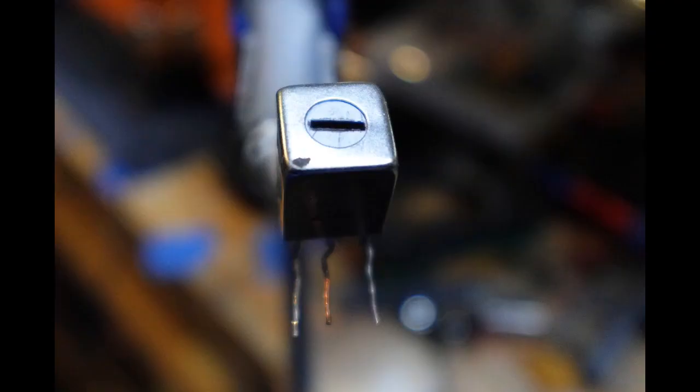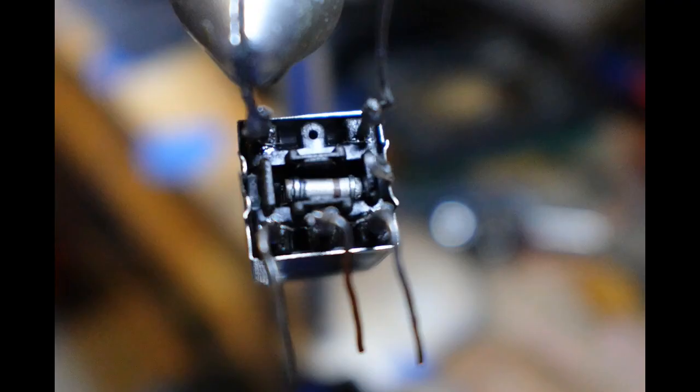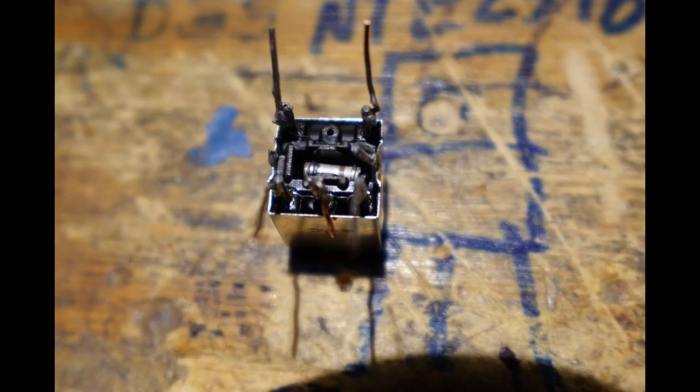Okay, more information on the little metal can on the left-hand side with the white adjusting slug. If you turn it over, there's a little tube inside. Well, that is a capacitor. Now, it comes with that. It's probably 180 picofarads. I can't guarantee that. Well, be careful, because if you're not getting the right frequency or it's not oscillating, look at that to see if it's actually there. If it's missing, you're going to have to add something, and that's what I did with the 151 picofarads.